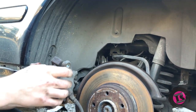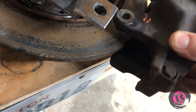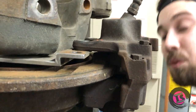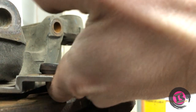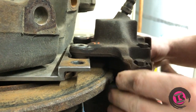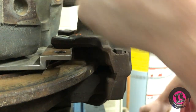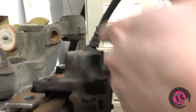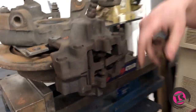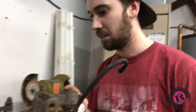It's short enough - the piston length is short enough that it won't interfere with the lateral arm. We're almost in the perfect spot, almost level with that edge. All I have to do is machine a bar that goes across with some threaded holes in it, and then I can account for the step. We've got plenty of clearance to clear the lateral link arm and plenty of pad contact. It's a smaller twin piston caliper but it'll apply plenty of pressure to lock up. This is going to work out pretty damn good.